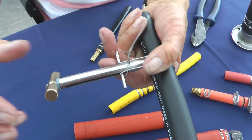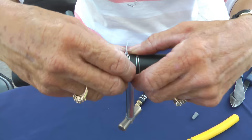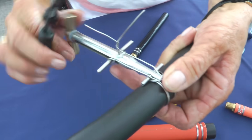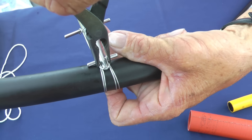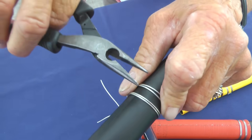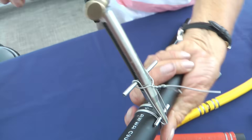Now just put light pressure to it, and as you do, that's where you form the clamp the way you want it for whatever application you're using it in. Use needle-nose pliers to work it around. A tip: squeeze on the outside of that cross wire — that does two things. It allows you to downsize it more easily so it falls in the barbs of the fitting, and it also cleans up the look of the clamp all the way around the backside.